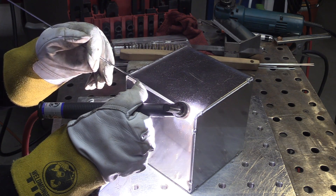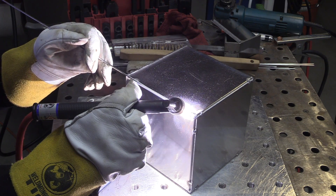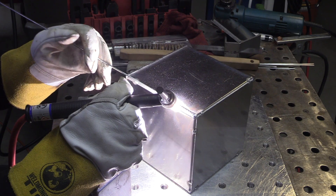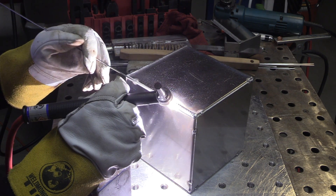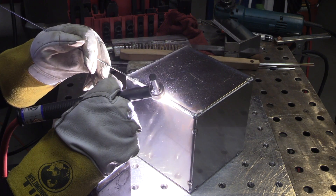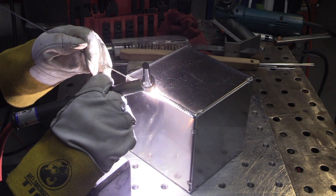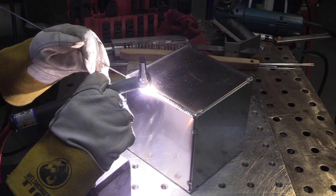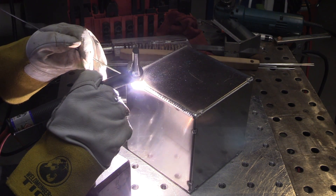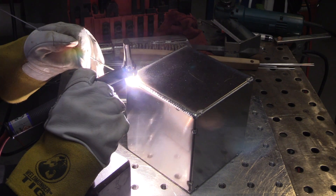Something that occurs to me right here: because I'm welding an aluminum cube on an aluminum fixture plate, if you don't weld on aluminum surface a lot of times you'll get arc marks on your aluminum part — especially if you weld on a carbon steel table with hot rolled mill scale on it. You can eliminate that possibility with a direct ground, a third hand providing the ground, or things like that. Just another plus on this aluminum fixture plate for welding aluminum parts.